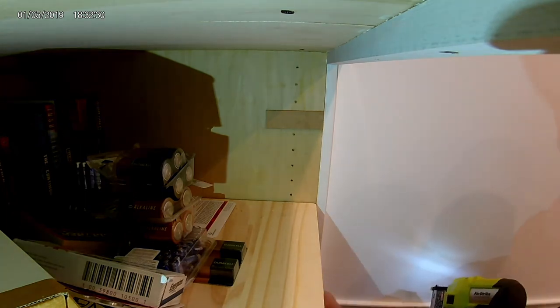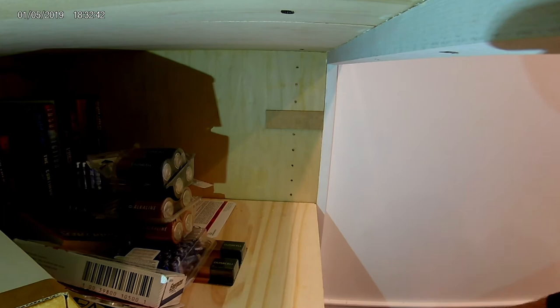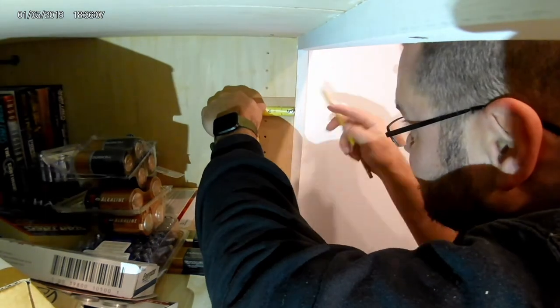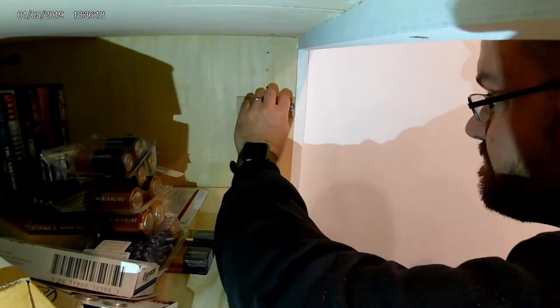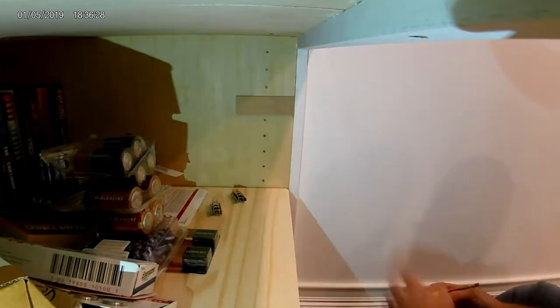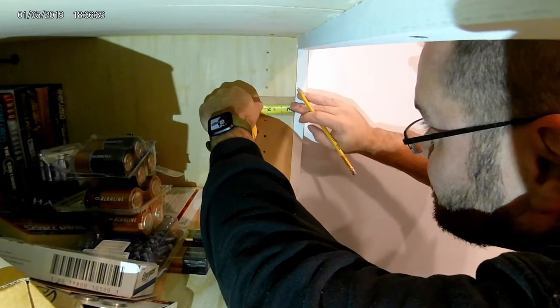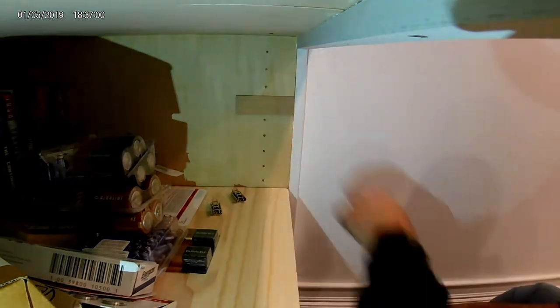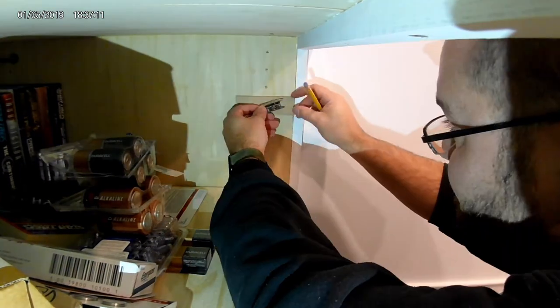And I did flush. Now, I used the frame to hide the plywood. And everyone was telling me what you should have done is just use a veneer. But remember when I was telling you earlier, my cuts were a little out of whack by a quarter to an eighth of an inch. And that would have essentially affected the face frame without this 3/4 inch piece.